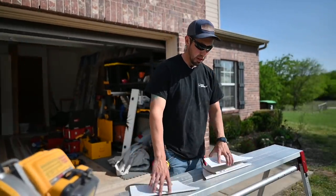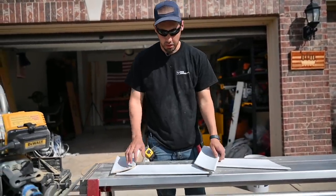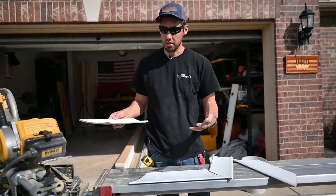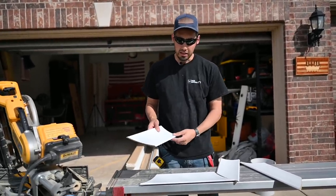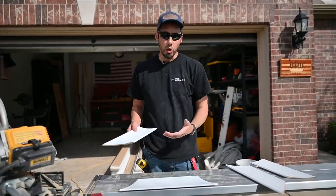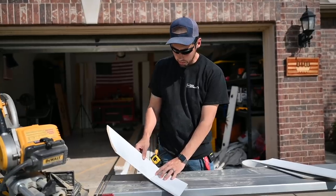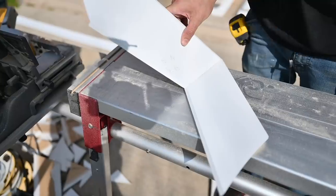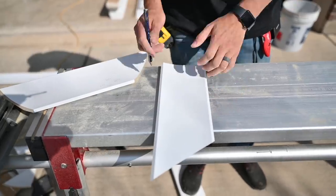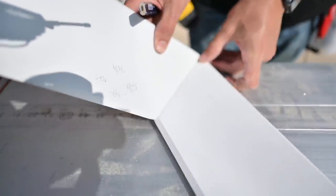All our pieces are cut for wrapping around the range hood cover — these three right here. I'm only going to slot the two side pieces where the exhaust air comes out. What I need to consider on slot placement is where the coped crown is going to come in. I'll hold it in place and draw a pencil line so I know the slots can't go past that line — that's where the next piece of crown copes into it.